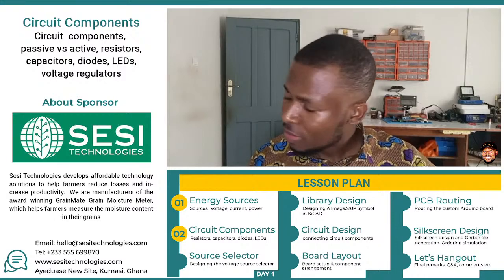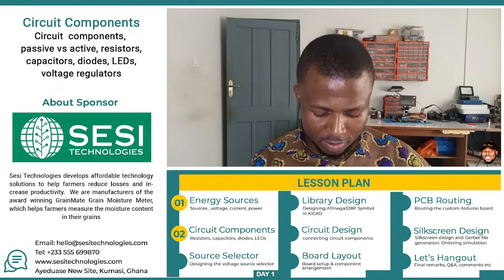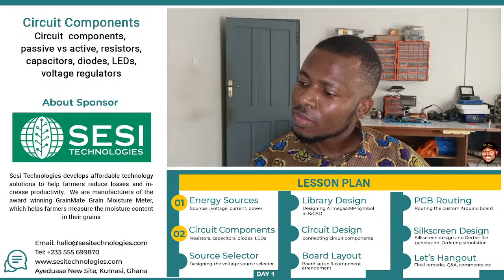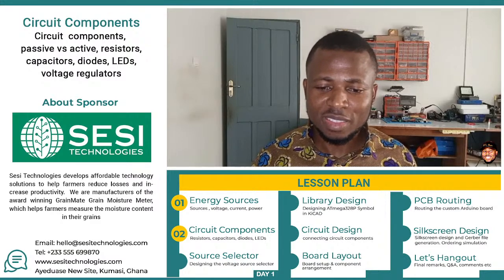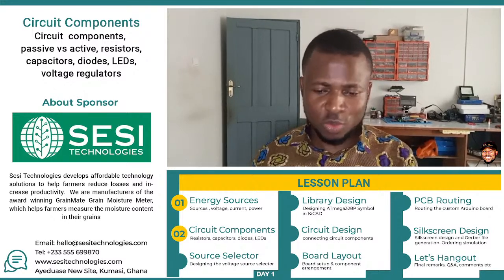The diodes are used as a one-way switch. Like they can block current. They can allow current in one way. So can you say that that is the case also for the LED? Because most of the time they're used for indication purposes. So can you say that many LEDs can also be used to direct current one way? Actually, yes. LEDs are diodes. The only difference is that they produce light when they are conducting. So if you connect an LED in a circuit, you have actually connected a diode. Everything a diode can do, an LED will do the same thing. It will also allow current to pass one way, not the other way around.